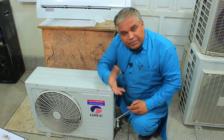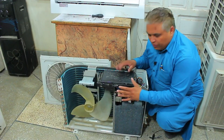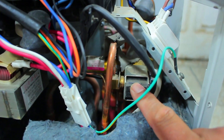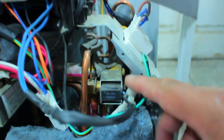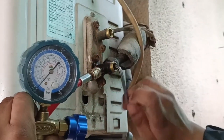I will now tell you the third method, which will be useful if you are trying to recover the refrigerant in winter. I will remove the front cover of the outdoor unit. After removing the cover, you can access the circuit board. You will have to target the solenoid valve coil installed in the unit — the coil in this unit is black in color. A wire is attached to the coil which connects to the circuit board. When you have traced the connector position of the coil, push its lock inward and remove the connector from the circuit board. After doing this, start the unit in heat mode. The outdoor and indoor units will start to work, but the outdoor will only work in cool mode because we have disabled the reversing valve. You can then easily recover the refrigerant with the procedure described at the start. If recovering refrigerant in summer, just start the unit in cool mode — no extra measures are needed.